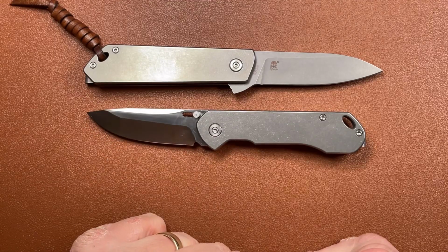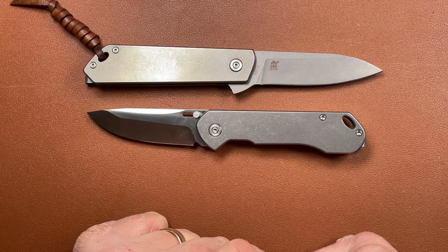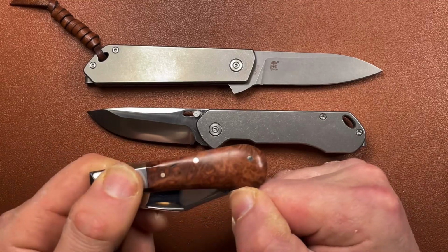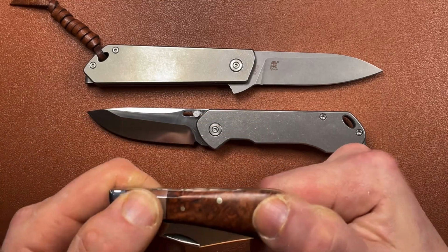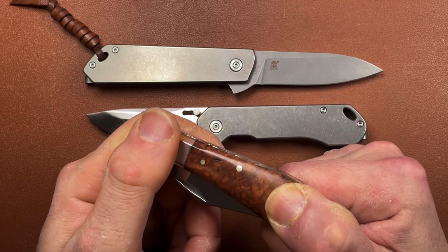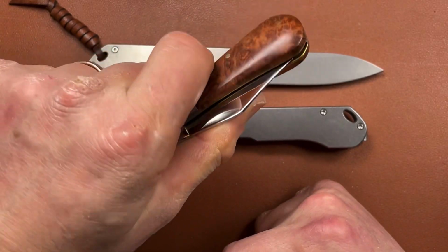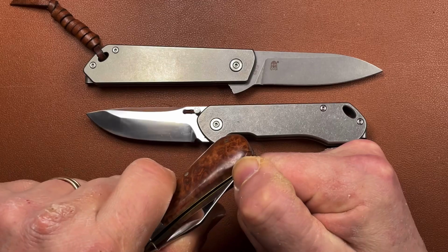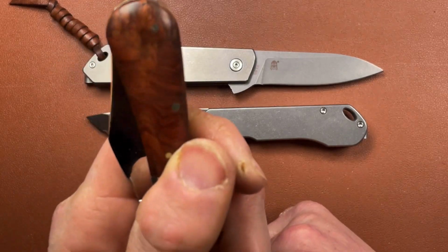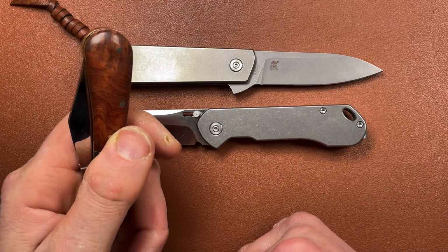I was talking to Lee White the other day about the way that a Barlow knife is polished, and to get this kind of rounded, barreled shape, you have to take all these expensive pieces of a knife that you've polished, you've put them all together, you've knocked the knife up, you've put the wood on, but it's a square block, and then you have to take it to a grinder and grind that curve in. How much of a hard line do you leave along here? How much do you crown it? It's just a difficult skill to learn. And the only way to learn it is to take an expensive thing and grind it. And if you overgrind it, you've ruined it. If you undergrind it, there's room to correct it. But if you overdo it, you've ruined it.